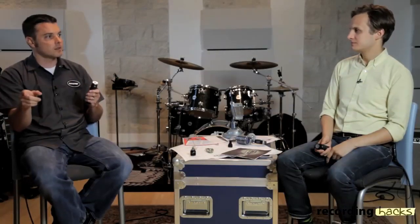And you have to look at it holistically, saying, we have to take a step back and say, if I change this part, what's going to happen with this? What's going to happen with that? So there's no solo button in designing a mic. You can't mix the snare and solo. No way. Every part is doing something else. The resistance is doing this and that. The cavity volume is setting this time or this volume of air. They're all interrelated. It's very complex. And that's with only two of our three problems addressed here.